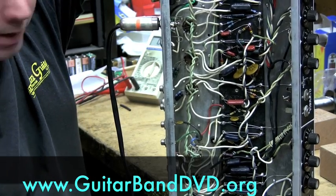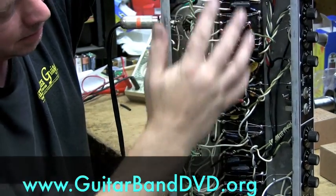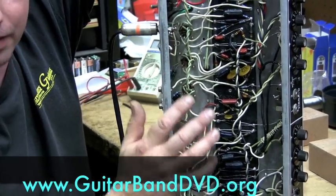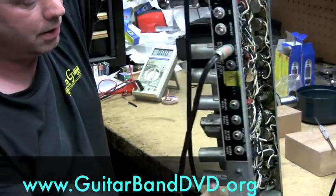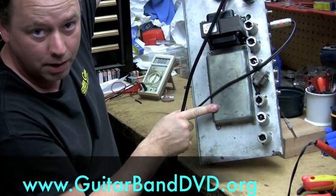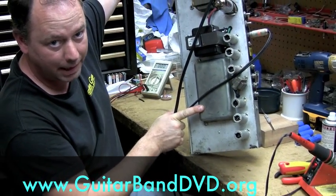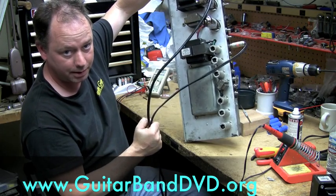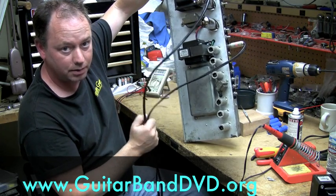But in the basic survival guide, you should never touch anything inside here unless you know what you're doing. Because there are several components on the underside here underneath this special cap that carry 400 to 500 volts of power even when this is unplugged. They're capacitors. They will hold a charge, sometimes up to days after. You discharge them?